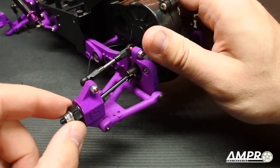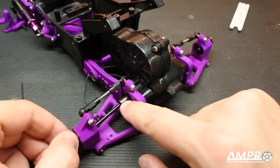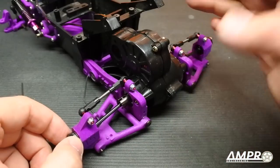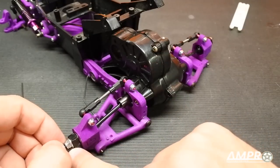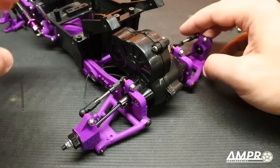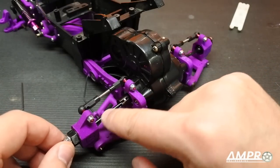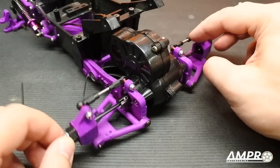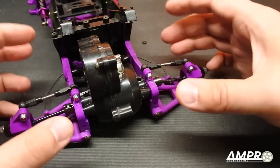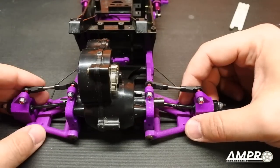Note that I put the roll pin and hex output on both shafts. With Tamiya kits you're usually required to put an O-ring inside the drive cup to prevent the dog bone from contacting it — that applies here too. I actually shimmed the outside so it wasn't necessary, but I'd recommend putting an O-ring in if you don't have 5mm shims, just to prevent damage from axial movement. There can be manufacturing differences between drive shafts, 3D printed plastics, and injection molded parts — really it's a tolerance stack-up.